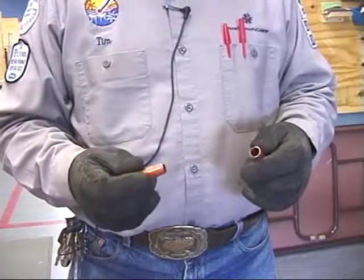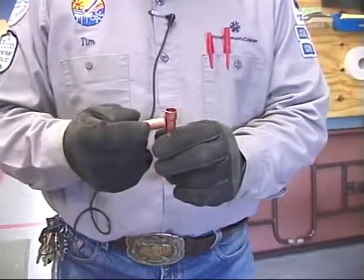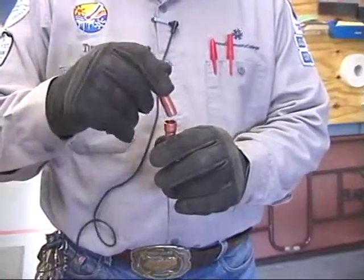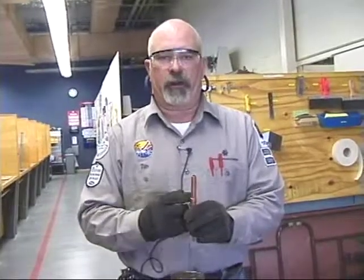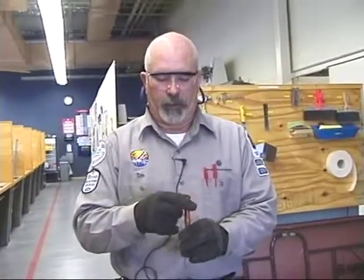Eventually you're going to clean both of these ends and you want them to slide in and fit together. The swaging tool is used when you do not have a fitting out on the job site. This is very easy to do, it doesn't take a lot of time, and it does the job properly. You want it nice and tight, and eventually you're going to solder this — we'll cover that in the upcoming labs. Follow your instructions, make as many copies as required, take your time, do it properly, and you'll come out with a perfect product every time.